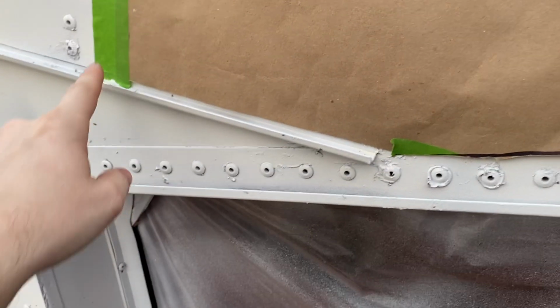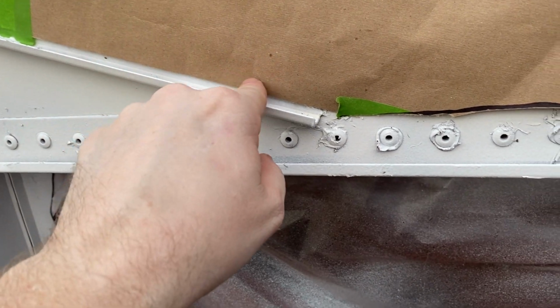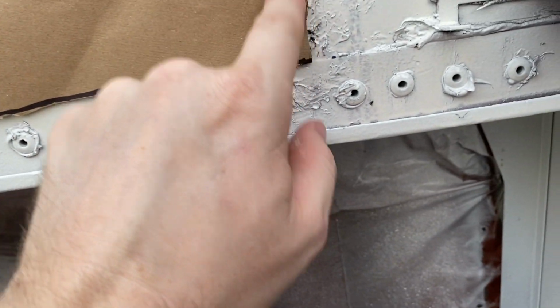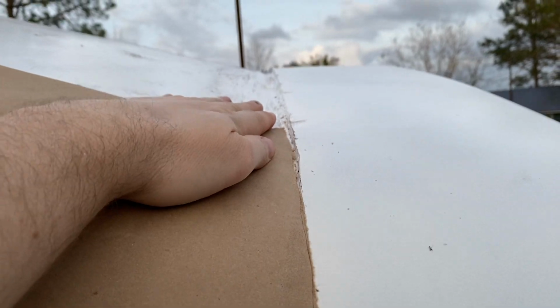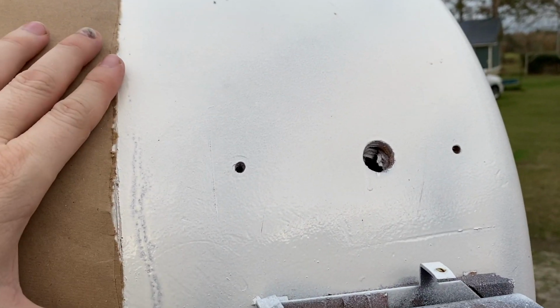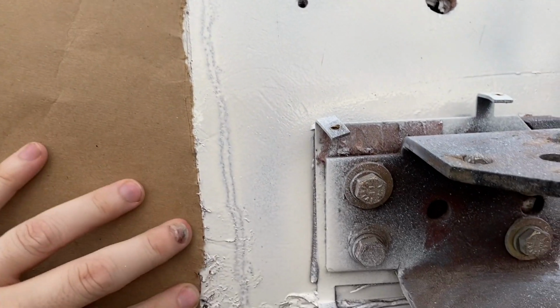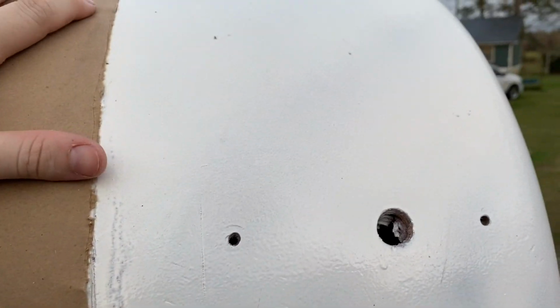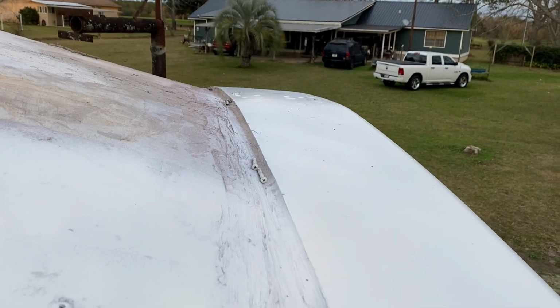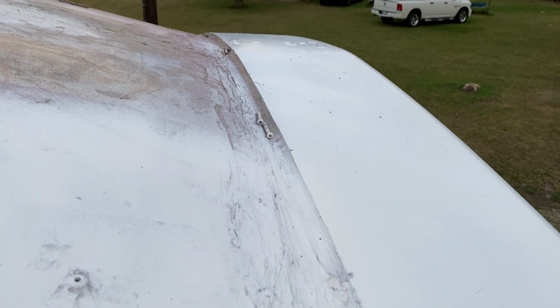And now we've cut. And so we have our original square line, if you remember, that comes to this corner and follows there, and then tucks in ever so nicely to our fiberglass cap on the front of our bus. I don't know how your bus is, but we have this nice little cap that we butted up against right there. And we need to go back and put a little more sealant there. Otherwise, we'll have a funnel that runs the water straight down into the cap, which is not good.